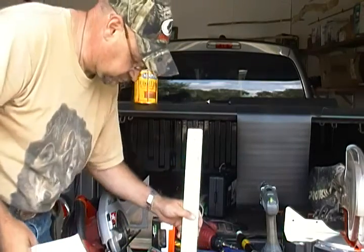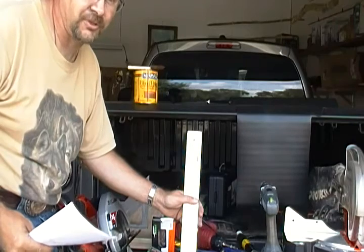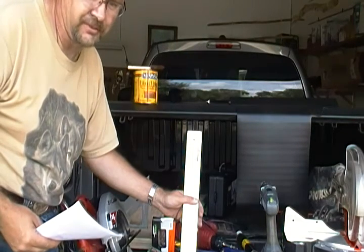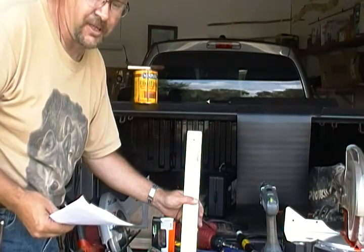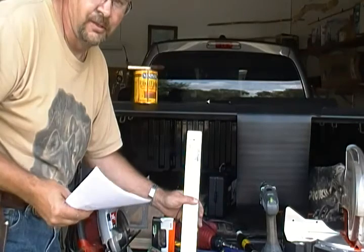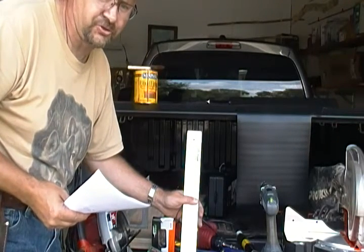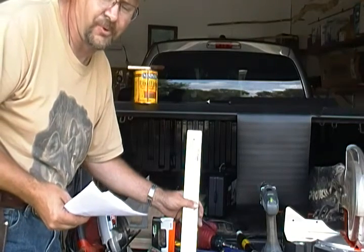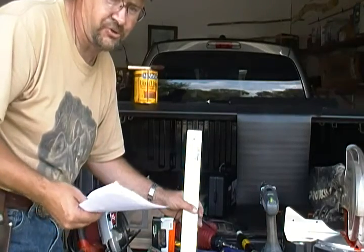One of the items I used was a drywaller's T-square, which let me draw some straight lines and let me mark off the screwing marks on the top of my bench. The screws are 8 inches apart all around the bench. There might be a few that are a little bit closer, just to even things up, or where I thought I needed to put another screw or two.